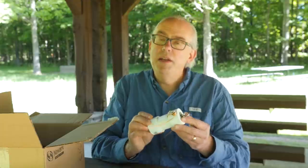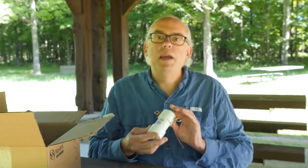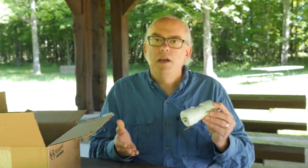Moving forward, I've got my parts here. First off, we're going to need a balun. I did not build my own balun — I'm kind of cheating there — but as Ina Garten would always say, if you don't have homemade, store-bought will work just fine. So we've got the MFJ-913 balun. This is the current balun, 4-to-1.